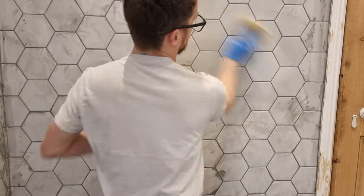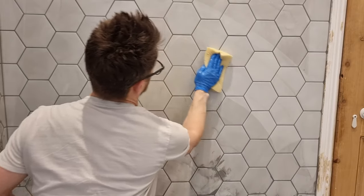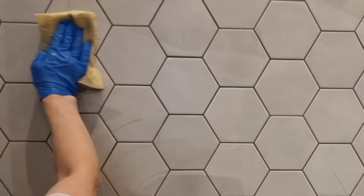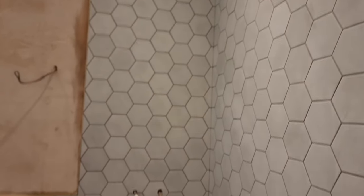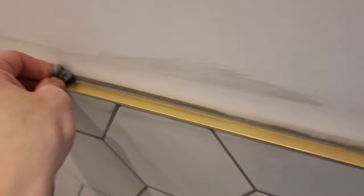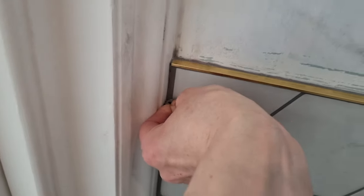Every tile is different - mainly natural stone and ceramic tiles will go off quite instantly as those types have a lot of suction. But with porcelain tiles like these I can grout the whole shower cubicle before needing to wash off. I'll do two washes: the first is a dirty wash to activate the grout on the surface and start removing it, then a second clean wash. For both washes make sure your sponge is fully wrung out so you don't soak the joint. The dirty wash is more aggressive; the clean wash keeps it tight to the wall running at an angle. When one side of the sponge fills up with grout, flip it to the clean side. After the dirty wash, allow at least 10 minutes before coming back with your clean wash. Your clean wash is where you really shape the joint and get a nice finish. For edges, I just scrape along with the wedge held flat to the trim, then go over with a tight sponge to achieve a flush finish. You can use this same method in corners to neaten things up.